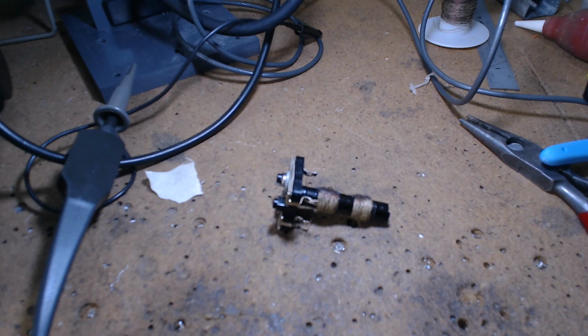In other words, the manufacturer sends you the coil set at a certain frequency, and you drop it in. Usually it just works right away, and you can peak it up. There's people that have to line every radio they ever got, but their generator is off. My generator for 455 is crystal controlled. I made it myself. That's what I use.